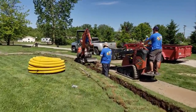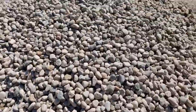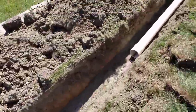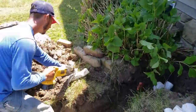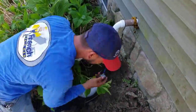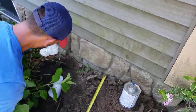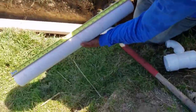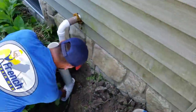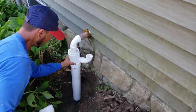We have the machine operators and Valentin — he's been just outstanding, what a great addition. He's in the trench keeping Francisco right where he needs to be. That sump line turned on and poured water and our trench was moving it. Our laser transit was on and we have it recalibrated. Guys, be aware — no matter how good a laser transit you buy, when you're driving down roads and hitting bumps, that's really hard on it. Try to keep that transit in the back seat of a four-door versus a rigid trailer with heavy suspension.